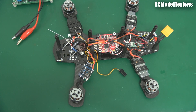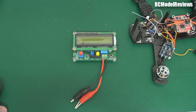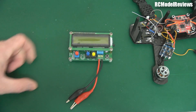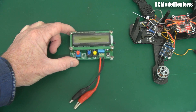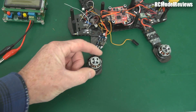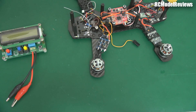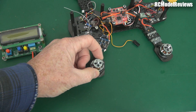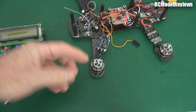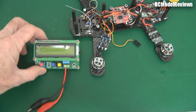There's one thing you can do — there's a very useful tool, really cheap, that you can use, and I've actually found this to be worthwhile in many applications. It's really worth having one of these. And what's that? Well, that's an LC meter. An LC meter measures capacitance and also inductance. Inductance is basically the quality that a coil has — it resists changes in the flow of electricity. Now you could say, why not just use a multimeter? The problem is the actual resistance of these motors is really, really small, and even a good multimeter isn't going to measure them accurately. You need a four-wire meter, which most people don't have and are very expensive. But these LC meters are cheap — you can get them for around 30 bucks on eBay or Chinese outlets.